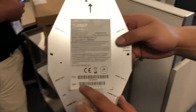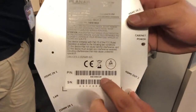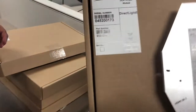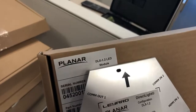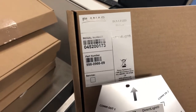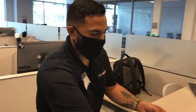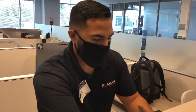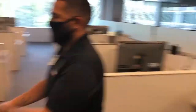The way you can tell you have the right batch: look at the back of the sticker or the label on the cabinet — it says 'dash 0.9.' Confirm with the sticker on the box that it also says 'dash 0.9' — DLX 1.2 module. Confirm those are the right part numbers and you're good to go. If the batch is different, they might have a different brightness or different colors. If you put in a dash 0.8 module, for instance, it'll be a little dimmer or brighter than the rest. No matter if you send it the right firmware as the rest of the modules, it'll always look different. So get the batch number right.